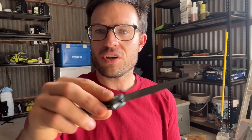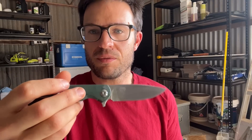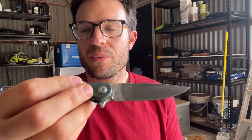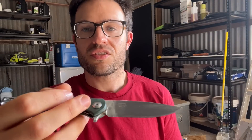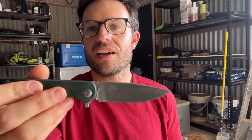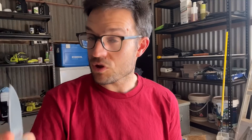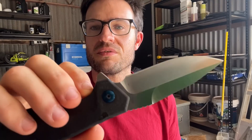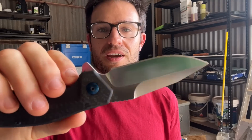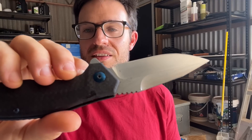So the four knives after that pretty brutal long-term submersion in bleach, vinegar and rather salty water. The Ganzo had a dramatic sort of colour change from the part that was in the water, and as the water receded down, there was heavy rust that built up. But interestingly enough, that's the part that hasn't now turned to the blackened finish. That's why my K390 Spydercos look the way they do — because vinegar does add a blackened finish to carbon steels. So the D2 was obviously the most affected. The next most affected was the S35VN, just in terms of having a bit of rust that I can't quite easily scrub off even after soaking it with CLR.